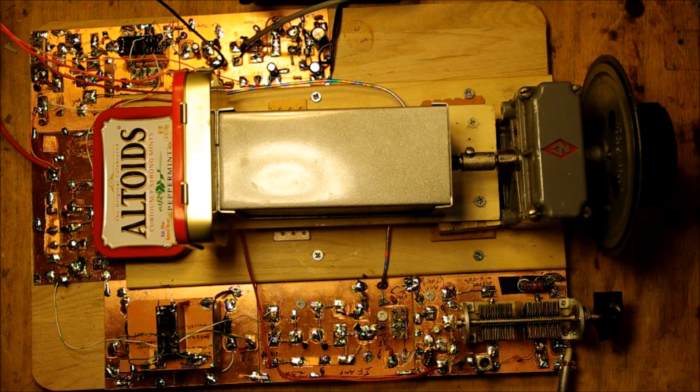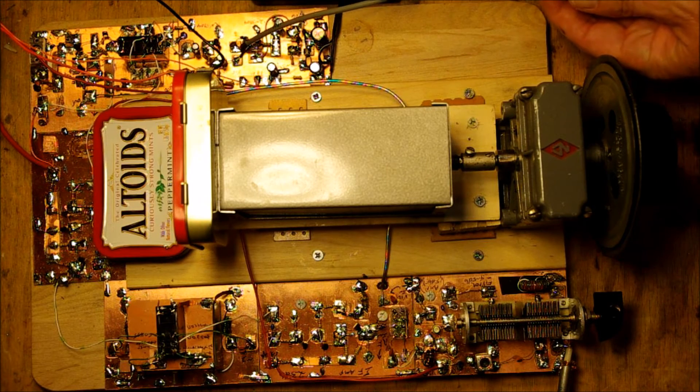I have a couple of diodes over here right now but they don't seem to be doing too well. This is the audio frequency amplifier — not an LM386, not an op amp, but individual discrete transistors. It uses a complementary pair: 2N3904 and 2N3906, with no need for an audio frequency transformer. It's a neat little circuit that we used a lot in the Bitx rigs.